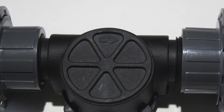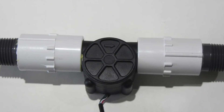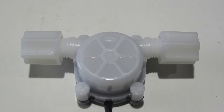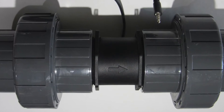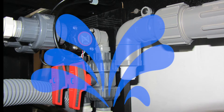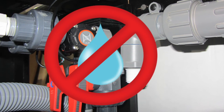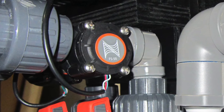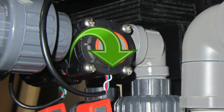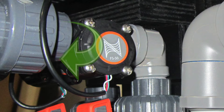When installing the sensors, it is important to notice the direction of flow indicated on the housing of the flow sensors, shown in these pictures. If the sensors are not installed correctly, this could affect the reading sent to the FMM. Flow sensors are water resistant and will withstand an occasional splash or drip, but they are not waterproof. For best resistance, orient them so that the point where the cable enters the body of the sensor is pointing down, and if possible give the cable some slack to avoid putting strain on it.